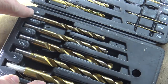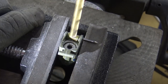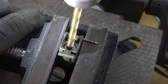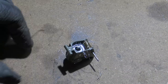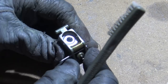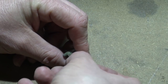The next step is we're going to use a one-fourth inch drill bit and we're going to drill out that hole. I'm going to be using a drill press, but you can use a regular hand drill if that's all you have. Once we've drilled through and cleaned it up a bit, we've got a nice drilled hole that goes completely through. Now these 209 shotgun primers will fit right in there.